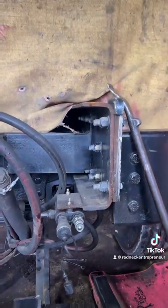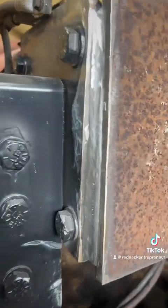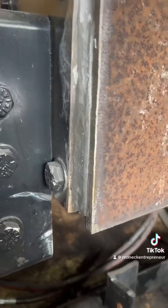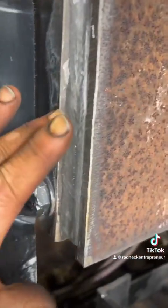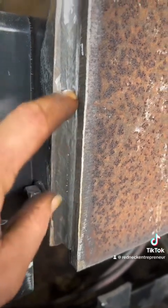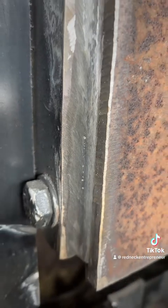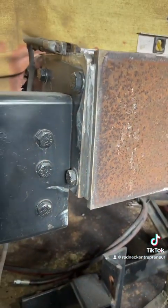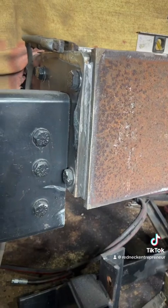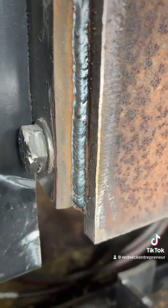Let's clean this stuff up and get to refabbing. I don't know what was in this material when they welded it — that's my third pass right here and I'm still popping inclusions. There is some seriously nasty stuff going on in there. I've got a little more grinding to do, get those inclusions out, and I'll just keep filling her up until they go away.